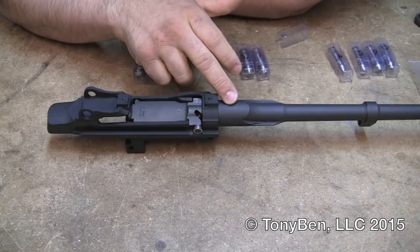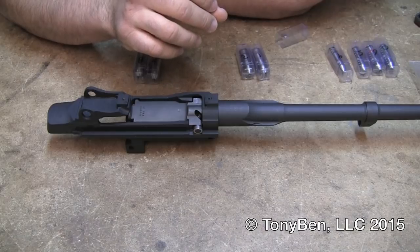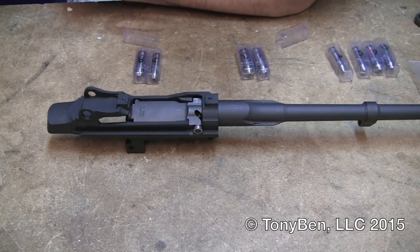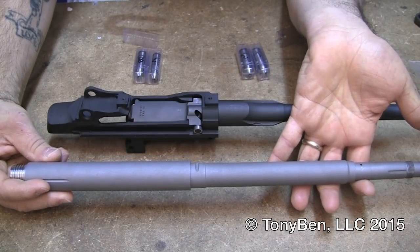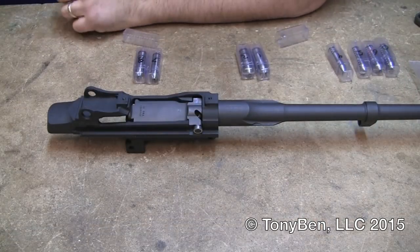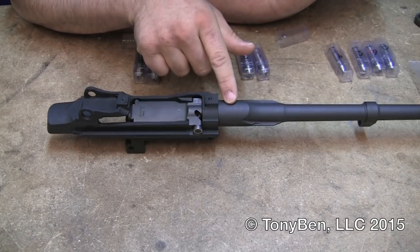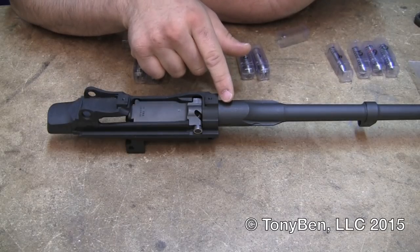However, like I said, this is an old Winchester GI receiver. There's no telling what a Criterion current production would do, which I think they're pretty much made to work a lot better with LRB receivers. And also, this barrel is actually not going on this rifle. This is my Wolf modified medium weight stainless steel barrel, and it's going to be short chambered anyway. So I'm basically going to ream my chamber to get my proper headspace. So this is only an issue if you have a chrome lined barrel, okay? And honestly, with today's technology, I really don't see much of a need for chrome lined barrels.